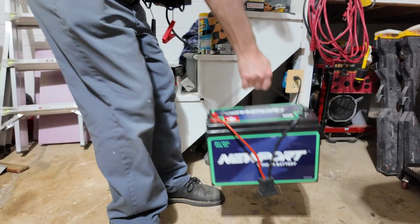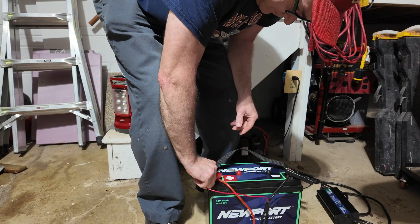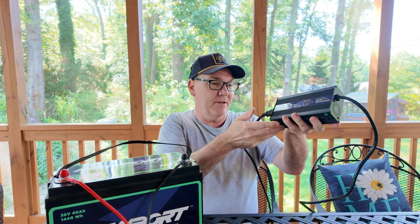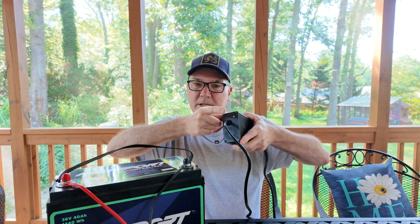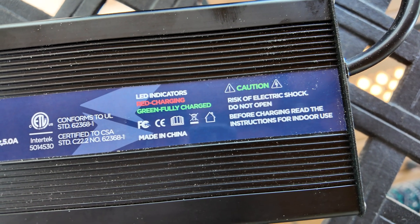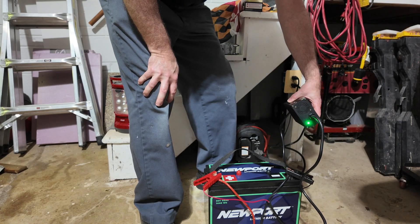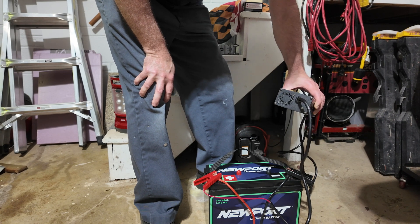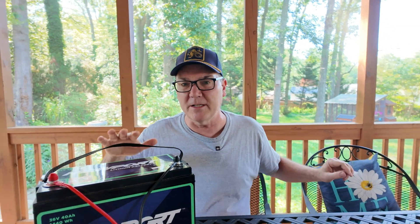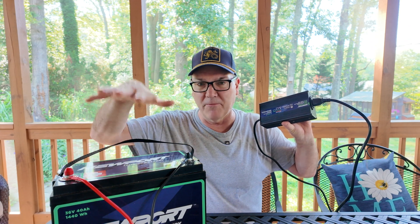I brought this up this spring to go use it again. I hooked it up to the charger that came with it — this Newport charger right here. When you plug this charger into the wall, the light blinks green. When you connect it to the battery and it's charging, the light goes steady red, a fan kicks on, and then the light changes color when it's fully charged. It wouldn't charge. I unplugged it, tried it again, re-plugged it in, left it sit for a while — it never took a charge. And the reason it didn't take a charge is because these chargers are not meant to charge them up from zero.